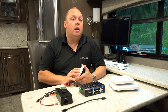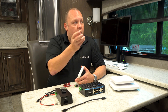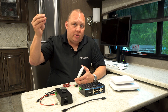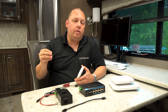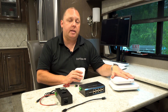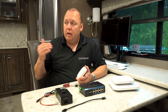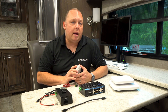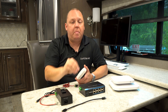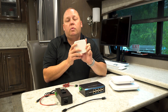Even though the AP Mini comes with a power adapter, it runs on AC power or 120 volt power — it has a wall brick like you see with most devices designed to run on home power. That wall brick is actually just converting the power from AC 120 down to 12 volt DC. You can run that AC adapter, and I'll put the part number below, to run the APAX devices as well. But if you're in an RV or boat situation, you typically have 12 volts all around you, so there's no need to go from your 12 volt house batteries up through your inverter to 120 and then back down to 12 volts. It's very inefficient — it's much simpler to hook these up directly to your 12 volt house batteries.